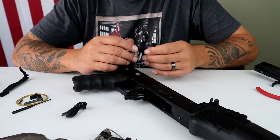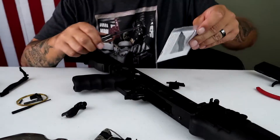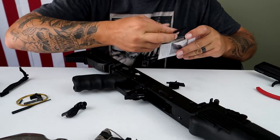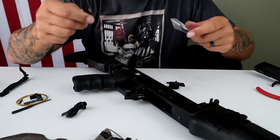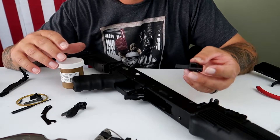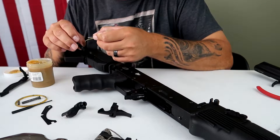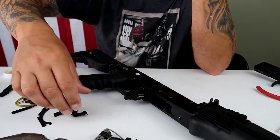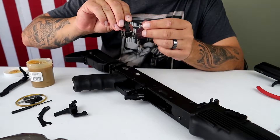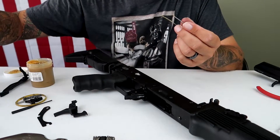So we've got that done. How about we put this joker together? I do have this retainer plate to put in there as well. There's been a little bit of headaches here and there, but that's to be expected. Another thing, guys - if you want to put some grease on your trigger and hammer pins, now's the time to do that. Just want a tiny little bit in there. Grease goes a long way, dudes.